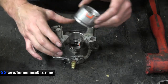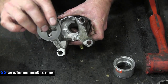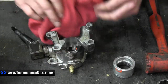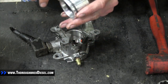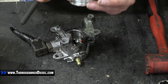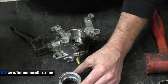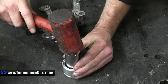We're going to go ahead and begin doing our reseal kit on the vacuum pump. Working with our middle half here — just don't forget to put your coupling key back in there, with the indention pointing towards the crankcase. Make sure you get everything cleaned up in there real good. Now we're going to work with our seal retainer. It's got a seal on the outside — we're going to remove that. Then the main culprit seal inside — we're going to remove and drive it out, driving it down with the spring. The open end of the seal is the direction we'll be driving it. I usually use just a one-inch socket and that works just about perfectly — rubber mallet, drive it out.